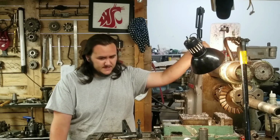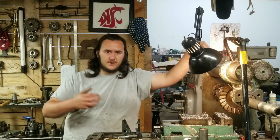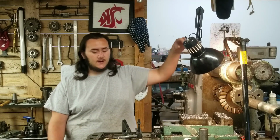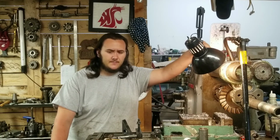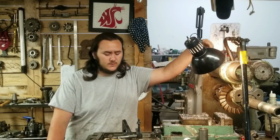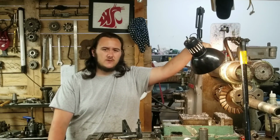I'm stoked to have the cross slide on the forging press and functional, have it be a functional tool, instead of a 200-pound chunk of cast iron that's just kind of floating around. There's still a couple of kinks I need to work out with it. It bends in weird ways. The frame it's sitting on, not the cast iron itself, bends in weird ways, and you can end up with lopsided forgings, which are kind of annoying, but you can work around it.